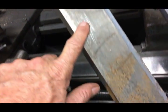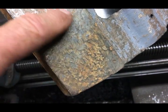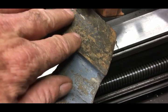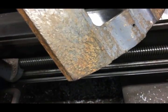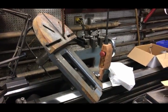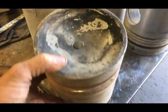These holes here will all be filled in before I machine it. I want to machine that whole top surface to clean it up - to me that's just abuse from somebody over the years. I'm making an assumption that probably tapping a chunk of drill bit into the Morse Taper adapter is probably what caused it, but anyway I just want to clean that up.